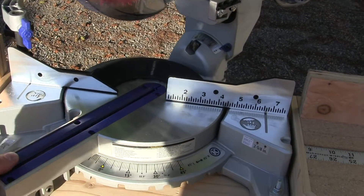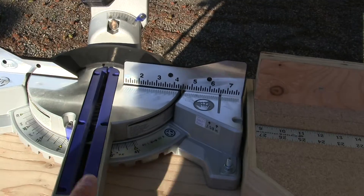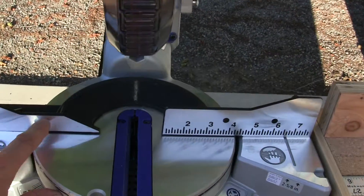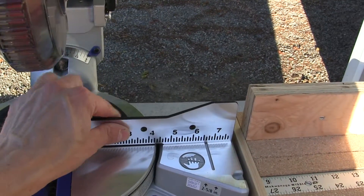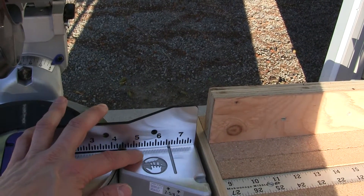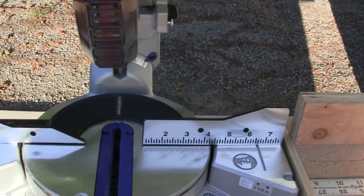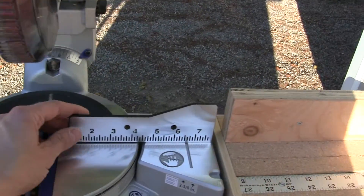Once it locks in, you tighten the steel bolt so it works really well. I found that the movement and the angles are very accurate from the factory. However, I did have to completely adjust the back plate — there are two large allen screws, and I found that very difficult, almost impossible to get it to within ten thousandths of an inch. But I kept adjusting it until I finally tightened it down to where I wanted it.